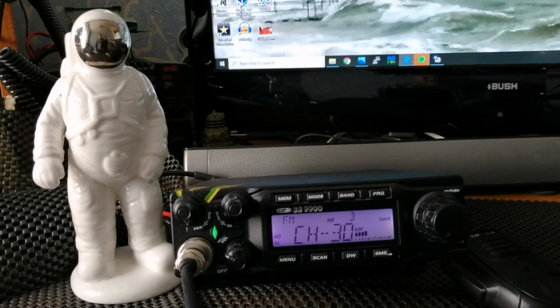Now, a word of caution here. Reading on other forums and from user feedback, these radios, like many modern radios, do tend to get a little bit hot. They are designed to be, but they're not recommended to be run at full power for any long duration. Some people have experienced finals failures on these radios, but that's only when they've had them on at full power and been using them for a very long time. Personally, it's like a racing car. A Ferrari or Porsche can do 180 miles an hour, but if you're on the autobahn, you wouldn't drive at 180 all day, every day. The engine would soon wear out or break. Same as the radios. If you're permitted in your area to run at higher power, turn them back to 70 or 80%, and they run a little bit cooler, and they will prolong the life of the radio and not actually break.